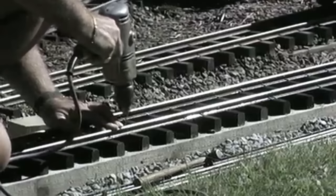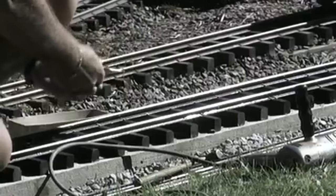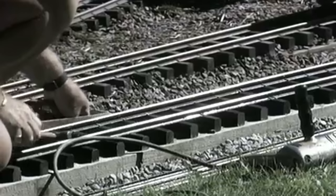After planning, laying out, and levelling the area in question, a trench about half a metre deep is dug and filled with coarse aggregate, and finally ballast material of finely crushed stone. On this bed, what are called battens are laid. These are longitudinal, laminated bearers of impregnated wood. On top of these, the track is built of sleepers and rails.